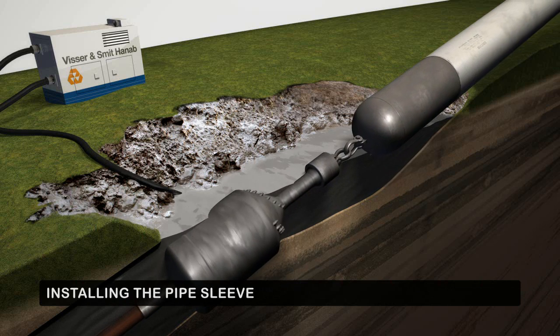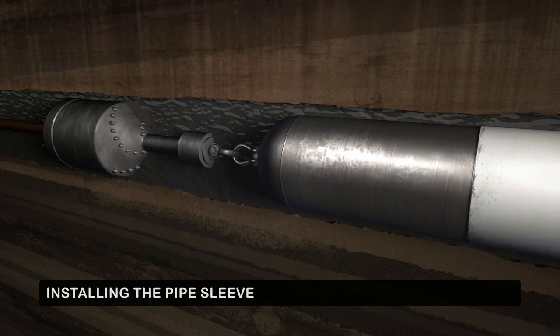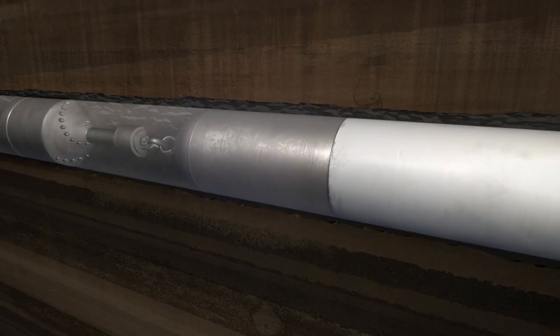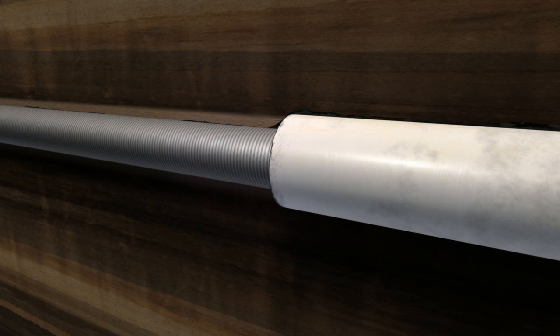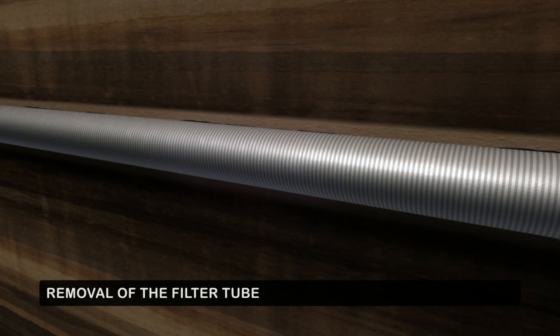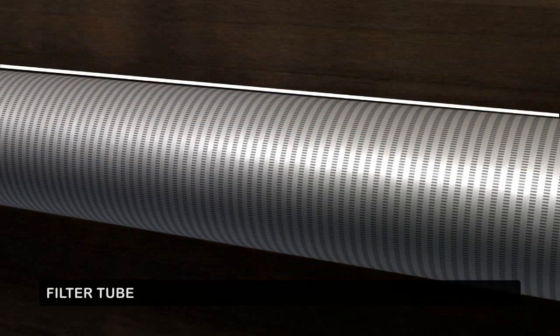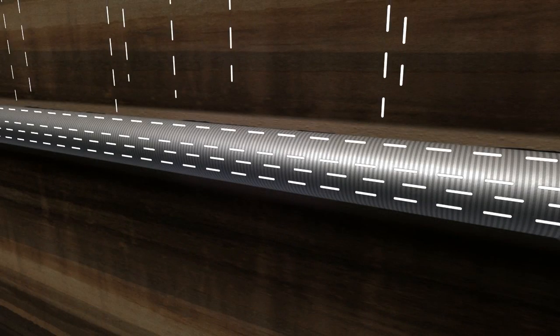The filter system is then installed. The first step involves installing a pipe sleeve. The natural area filter is used if the soil composition is consistent. A filter tube is drawn through the pipe sleeve. The pipe sleeve is removed as soon as the filter tube is positioned correctly. The drilling fluid is transported away from the drill location at the same time. The soil collapses around the filter tube and the water present redistributes itself along the soil and the filter.